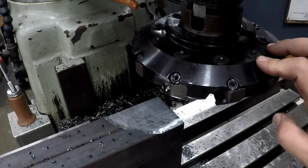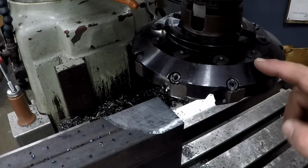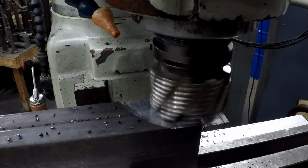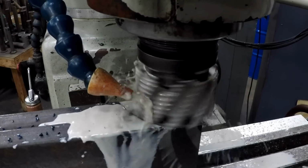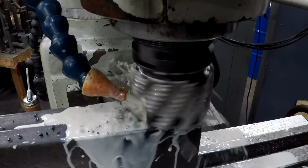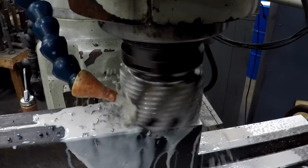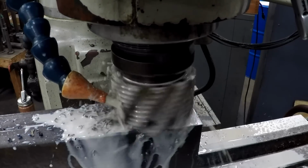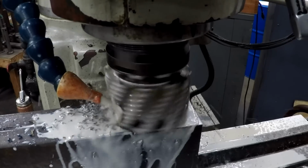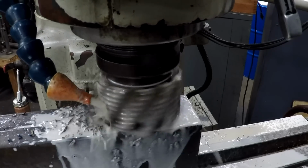So I'm gonna take this one out and put in a roughing shell mill, and it'll slice through that a whole lot better than a carbide insert will over here. All right, let's compare, shall we? All right, we're gonna get some coolant going. That mill there is actually pretty dull. It doesn't free cut as much as it should. I've got that one, and I've got a few others that I need to send out to a grinding shop and get them to regrind it.